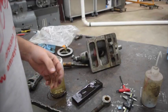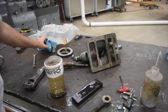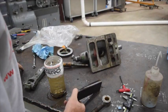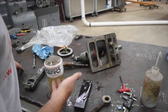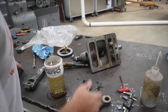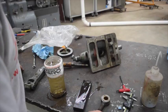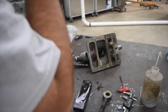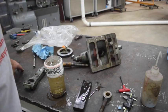Mill scale is very abusive on all your tooling, so when I can have time in advance, on a small part that you can cut to length and fit in something, it's pretty good to do that — for about 50 cents worth of vinegar. Anyway, we'll press that bushing out, measure the hole, and then start to figure out what we've got going here.